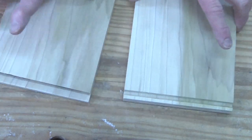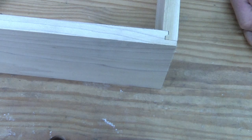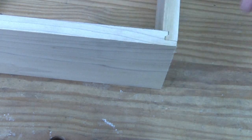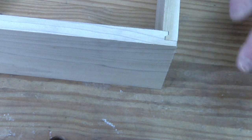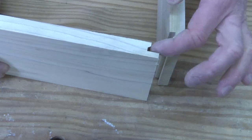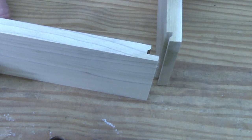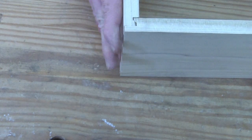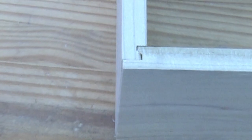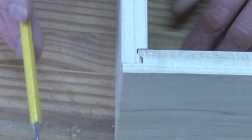The piece is through. You can see a good profile. I still got a little bit of chipping — a small amount of tear out. These are the actual two pieces I ran through and now let's check the fit. This was our front, this was our side, and they go together very nicely. From here on out I can save these two pieces and they will be my setup blocks. I won't have to use those precise measurements anymore — I can just use this to make sure the router bit barely touches and I'm good to go.